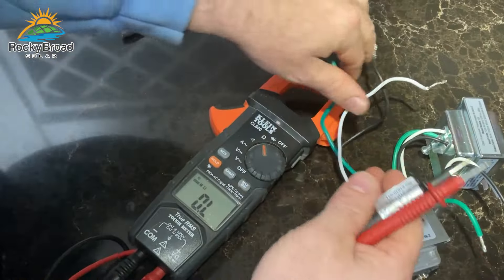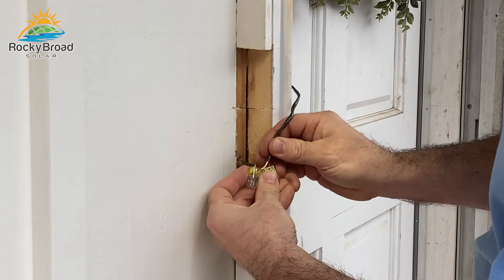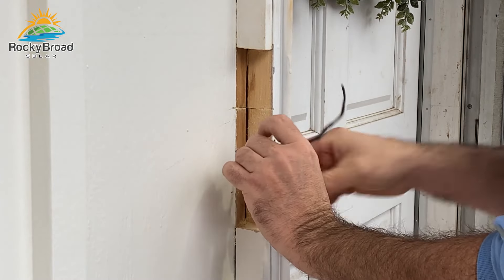If you're replacing an old doorbell with a new Ring hardwired doorbell, you need to hunt down your existing doorbell transformer and find out what voltage it is. My existing transformer was 10 volts, which is not enough — the Ring hardwired doorbell wants 24 volts. I got a Defiant tri-volt transformer, which covers pretty much anything you need for low voltage. I used the two outside terminals to get 24 volts, but it has three terminals so you can get an array of different voltages.